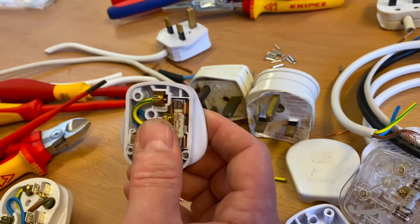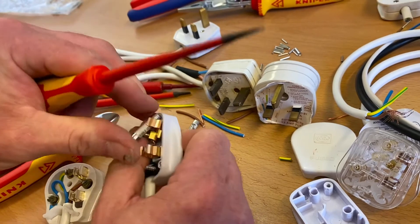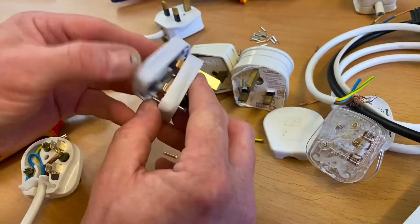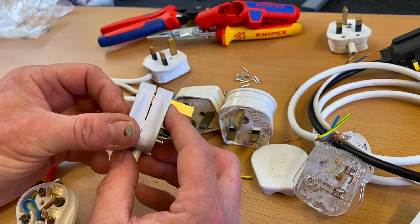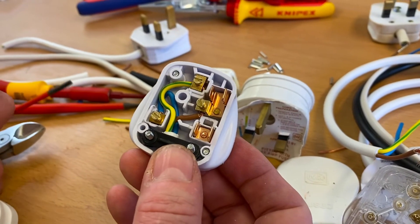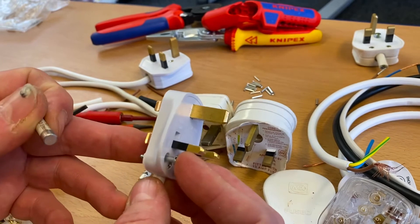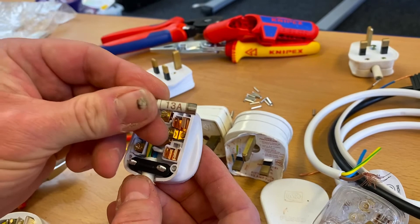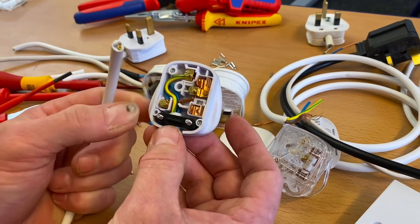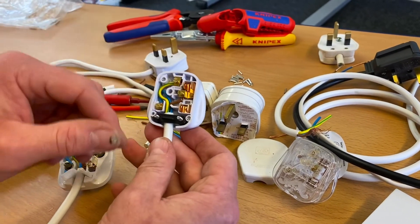If you're taking this to be assessed you would need to remove the fuse. We don't want somebody to plug it in and make the flex live - don't return the plug top together if you want it marked. So there we have it: our 13 amp plug top completed. I've taken out the 13 amp fuse - the common sizes are 3, 5, and 13 amps. These are BS1363 plug tops rated 13 amps and we must select the appropriate fuse size compared to the load. I've made off two different designs in this mini series on flexible cables - I hope this video has been some help.